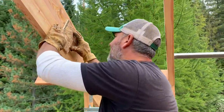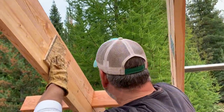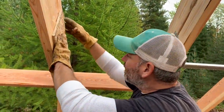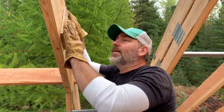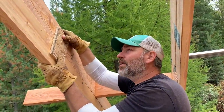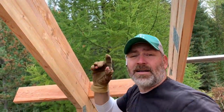We're going to put these guys over here. We're going to go right like this to tie this. This is a blocking right here. We've got our outriggers coming out right here, nailed into this truss, and then they extend out over to here, so that you can put a lot of weight here — such as 10 feet of snow or something. And these right here are blocks that are put in there, but we're going to actually put this here to tie it in, make it a little bit more secure. We'll put one, two, three on each one all the way around the house, on the north and south ends.